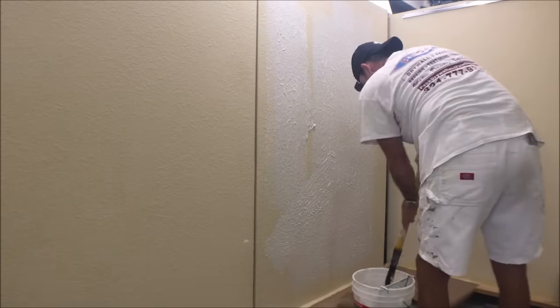I wanted to give you a view of the drying process — I get a lot of questions on how do you know when it's dry. Your skim coat is dry when it's turned white. If you look over to the right side you can see it's a little darker and above is a little darker — it's dried where the fan was blowing, so you've got to move your fan around. It's been exactly one hour. Probably got another hour and it'll be completely dry. If you want to step up your drywall texturing or painting game, be sure to hit the subscribe button. Thanks so much for watching.